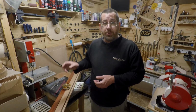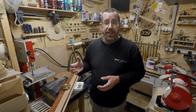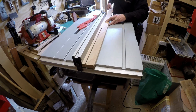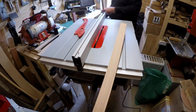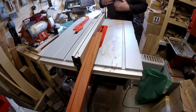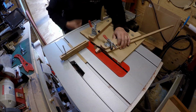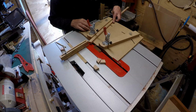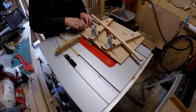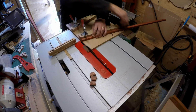Now, a lot of the work I'm doing here is going to be stuff that you've seen me do all the time before. I'm going to do this as a time-lapse video. I've just got a basic idea here of what I want to do for this project in the way of shape. So to start off with, I'm going to be making 2 segmented rings. After cutting some strips off at the required thicknesses, I then cut all the segments to the required length. As you'll see there on the table saw, you do get all these little fuzzy edges on the edge of the pieces. This means that they all have to be sanded, and it doesn't actually take too long by hand.